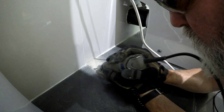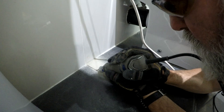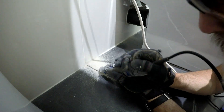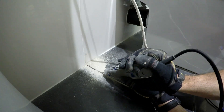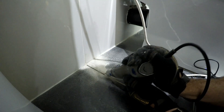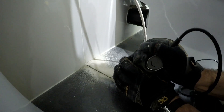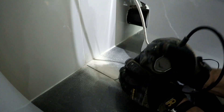Here's another example from a different angle. I'm not wearing a mask at the moment because the Dremel doesn't necessarily throw up much dust. I have sped up this video so it looks as if I'm flying through the grout line, but it's quite slow work. You will definitely need knee pads, because all your weight is on your knees when you're holding a Dremel like this.